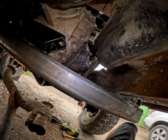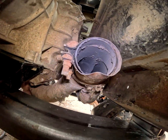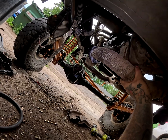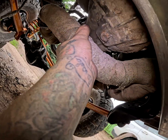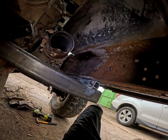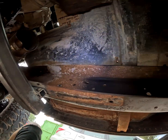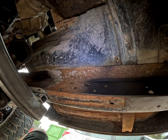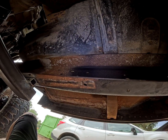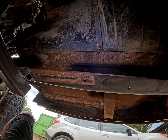So with this cross member setup, I'm going to put this piece that I fabricated years ago for my F250, but it looks like the exhaust is going to have tons of room, and it should actually be out of the way of the drive shaft, and then should still be able to service the transmission without pulling the exhaust. But as you can see, we have tons of room on this side, and we will be running a catalytic converter on this truck because of the engine year that we are choosing. So when we get our emissions test done, if they do decide to run it as an '87 Bronco, they'll be looking for all that factory emissions equipment. So if we put it on there, that should help our chances of passing.